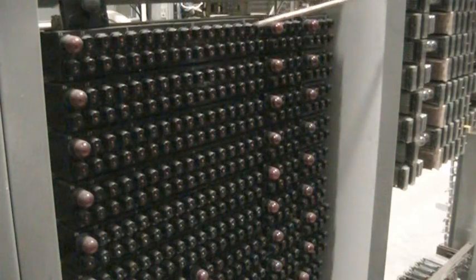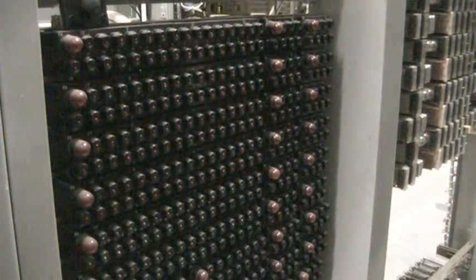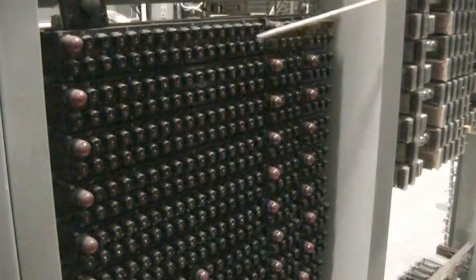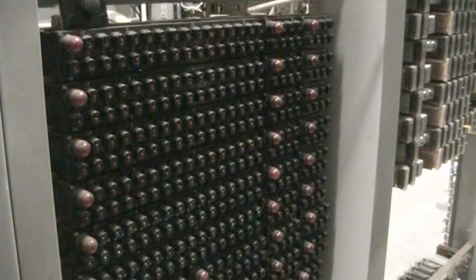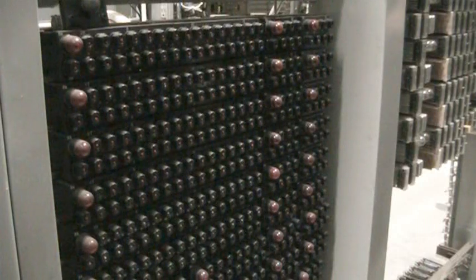In a step-by-step, if you were to ground the dial tone lead at a first selector shelf, you would affect most of the central office, at least the dial tone segment of the plant, ringing plant. Here, in the crossbar system, you would only operate a fuse. This was a pretty neat idea. One of the things that was an education for me is because I'm running this entire crossbar switch off of my Western step plant, I had to build some circuits to interface the crossbar to the step and to invert the ground source into a battery source.